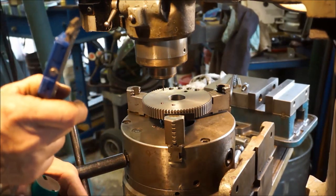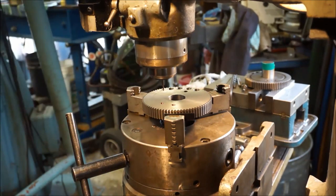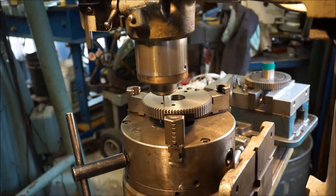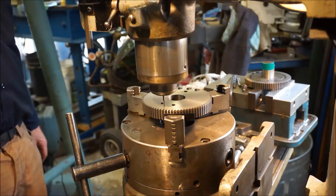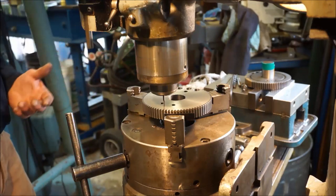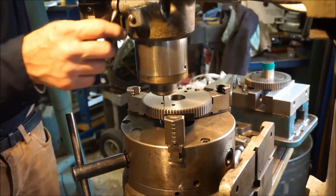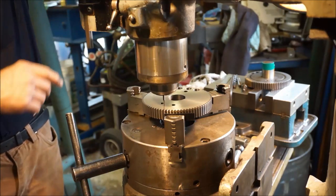Well, let's turn this thing on. About 15,000, 16,000. All we want to do is create a little bit of a valley there between these two holes, because of the pivot action or whatever's going to go in those. They want to keep it from rubbing or building up an area there or shouldering it out, some kind of relief, chip clearance, it could be anything. All right, I believe my speed is up to par. I'm engaging my spindle feed there, and we'll back this up just so it's not on the surface.